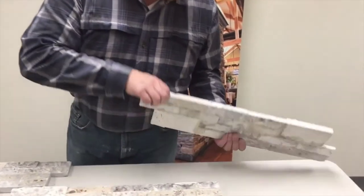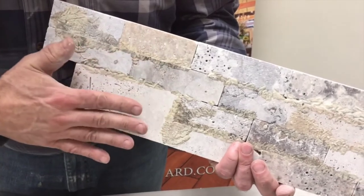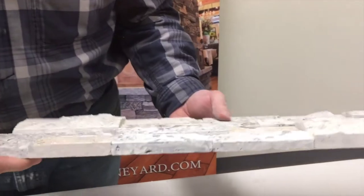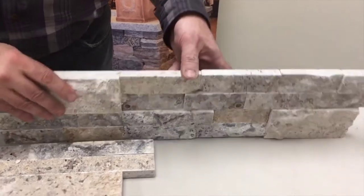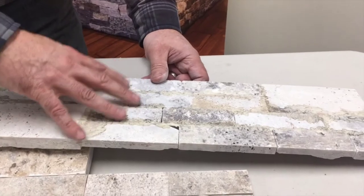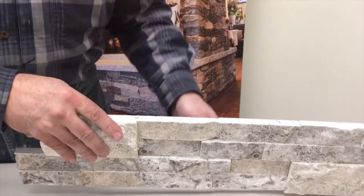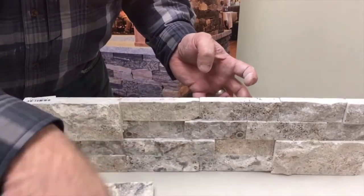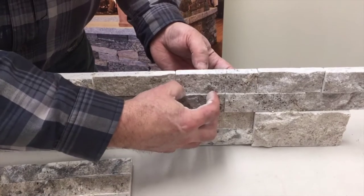Look at the back of these stones — you're seeing a sawn smooth stone with a little bit of glue in between. The glue is just meant to pre-assemble this piece, so every time I put one up I'm putting up one square foot. When I put the high bond Laticrete mortar and butter it on the back of this and then put it up on the wall, this cement is going to hold the stone together. Even if that glue would fail at some point later, it wouldn't matter because the high bond is guaranteed to hold this stone on.